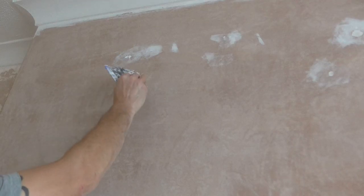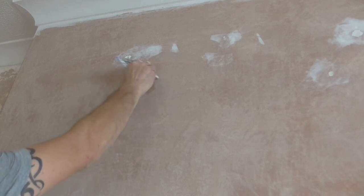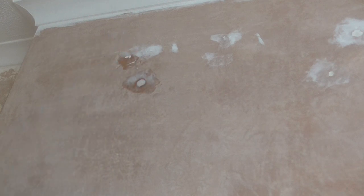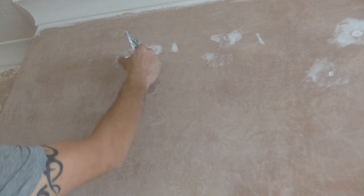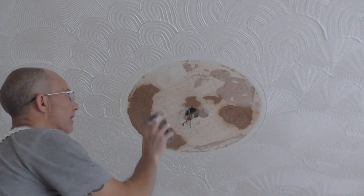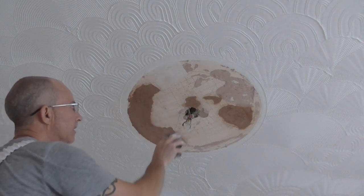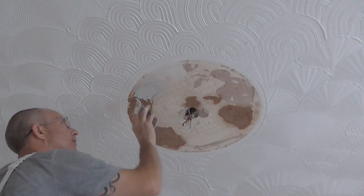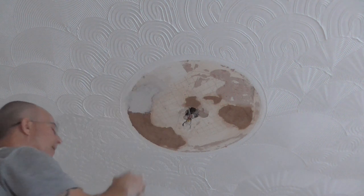So that's the bit where I put the undercoat plaster in before, so I'm going to top that up. When you put filler in and it's dried off, you always need to top it up because they do soak in a little bit and leave it slightly concave sometimes. So always make sure you top up your filler on the big holes. This is ready now to top up - I've already cleaned it off, so just needs a little bit of polyfiller going over there. And then the Artex.